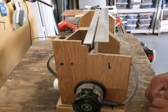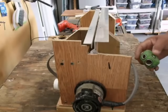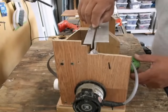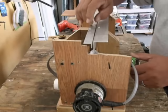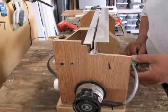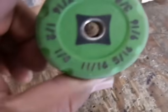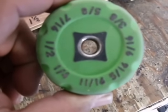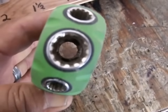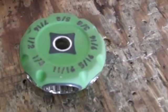Now you've totally reassembled the slider part. To adjust it, there are a few things and you may have to do them your own different ways. I usually take a long screw, put it in here, snug it down to the pinch points, and then back off until it drops. It's got to drop to the second level. You do the same thing on the other side. We got this little nut twister at Harbor Freight — it has metric and American as a whole, goes through both sides so you can tighten a nut that has a stud on it. It only costs a couple of bucks and it's well worth it.